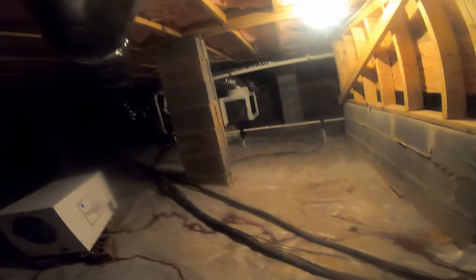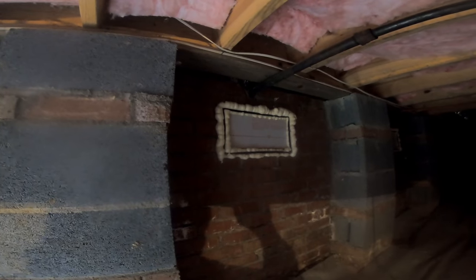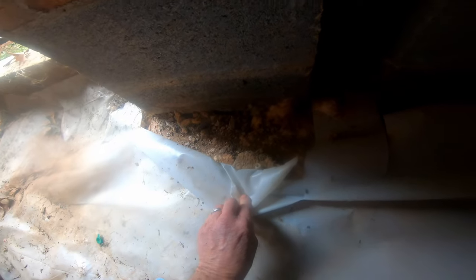Let's take a look - it's kind of dark in here but you can see it's nice looking, really good all around. No efflorescence, really dry crawlspace. What makes it dry? What makes this crawlspace dry is not only the drainage and the footer tile that's been installed here, but also that we've sealed the vents. This keeps that moisture out. When you have a vent that's open, or you have a fan on that vent trying to control your humidity, you're making it worse. They're all sealed all the way around - this is super dry here, rock hard all the way around.